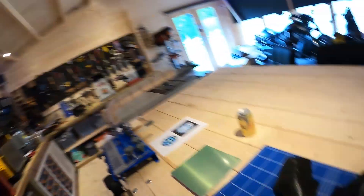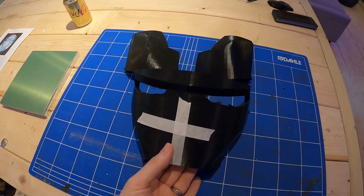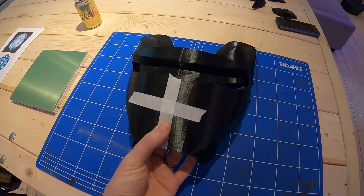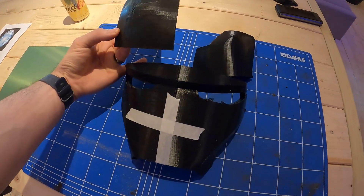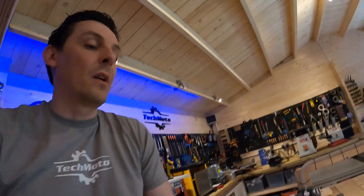We've finished 3D printing the face mask on the Ultimaker 3. The Ultimaker 3 isn't big enough to print the full face mask in one go, so we had to use a piece of software to slice it up, giving us four parts that come together. That's not actually a problem because I'm going to cast it in four pieces and then use some aluminium brazing rod and a propane torch to stick them together.